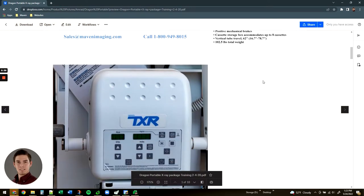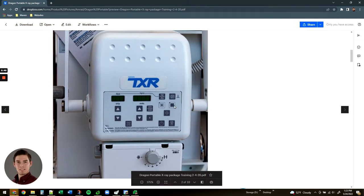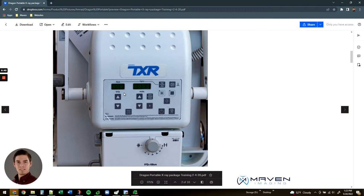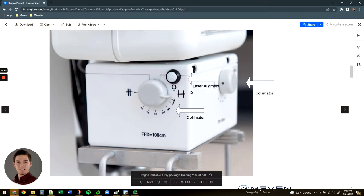Right from the beginning once you take it out of the box, you see here this is the head and the tube, and you've got some different adjustments you can make. You've got collimator adjustments — this is the vertical adjustment. On the side of the head you've got the horizontal adjustment of the collimator. To turn on the laser alignment of the collimator, you hit this button; it'll only stay on for about five seconds, so if you need to realign it you can just hit that button and continue aligning.